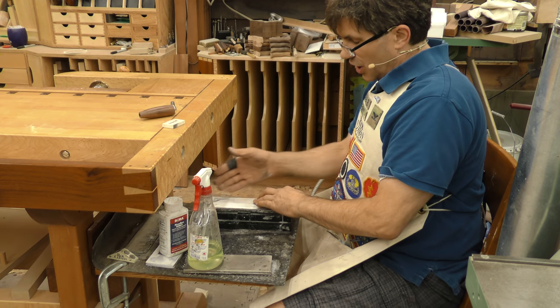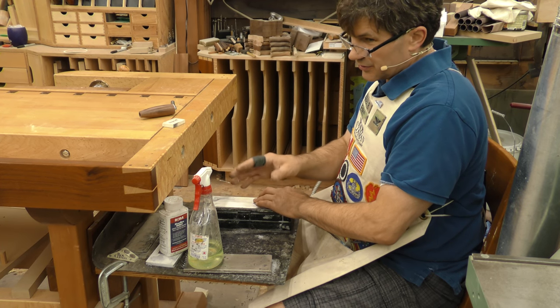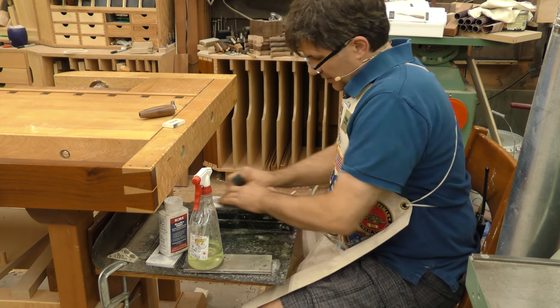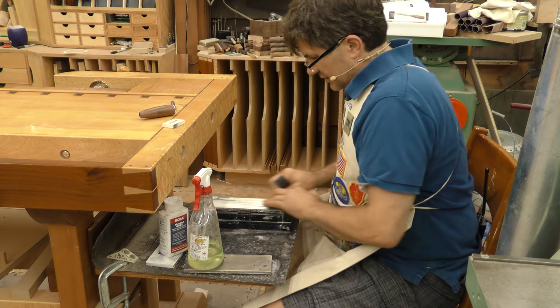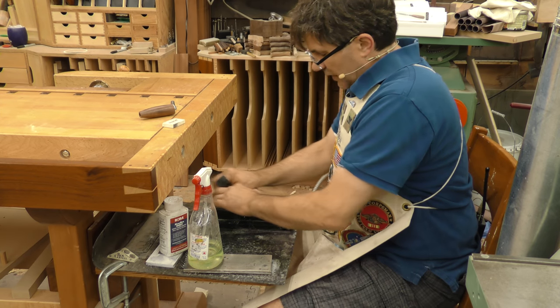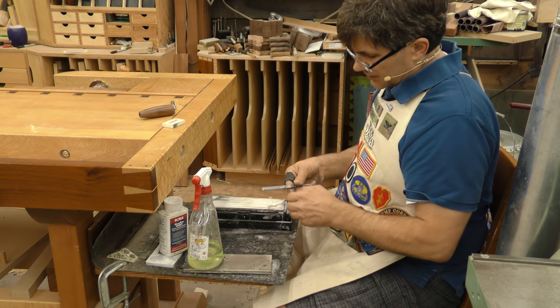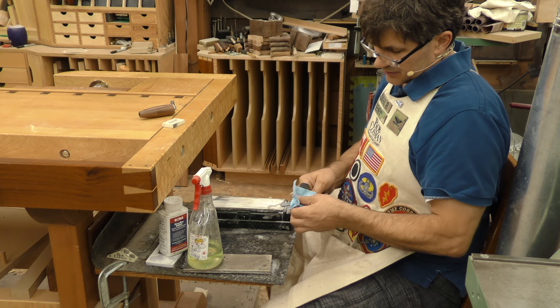The right side is always being used; the left side is used somewhat intermittently. Turning the stone balances out the wear. About a minute to a minute and 15 seconds into it, I'd stop and re-flatten, then start again — until I've replaced all of the 1000 grit scratches with 6000 grit.